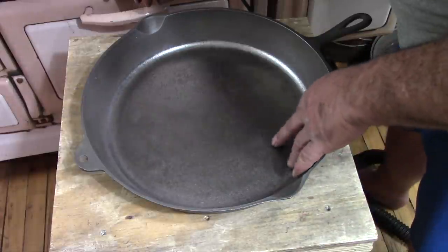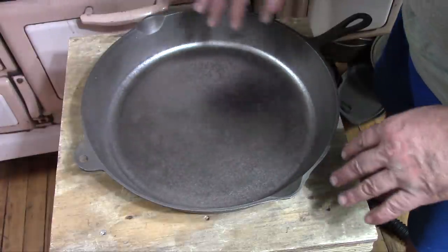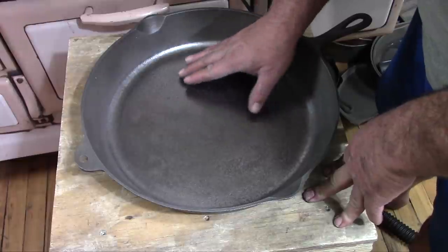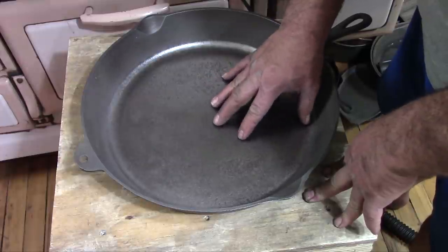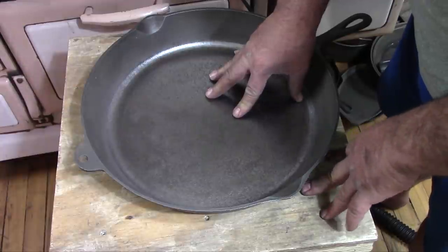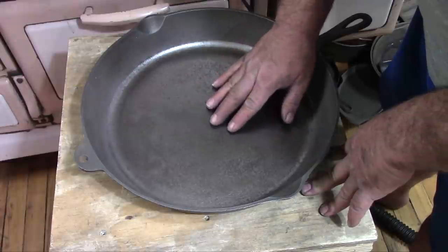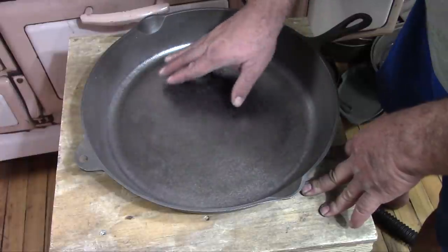This is about a half an hour's worth of work and I went through three sanding discs on the 50-grit coarse. You can see it's really made quite a bit of difference — it's taken out a lot of that real fine pitting. There's still quite a bit of the medium and heavy pitting, but running my hands over the surface, rather than having sharp-edged pits all over the place, it's taken the edges off and smoothed it out quite a bit. With a rough pan like a Lodge, what you're doing is knocking down the high spots, so there's a lot less material to remove and it'll get a lot smoother finish.